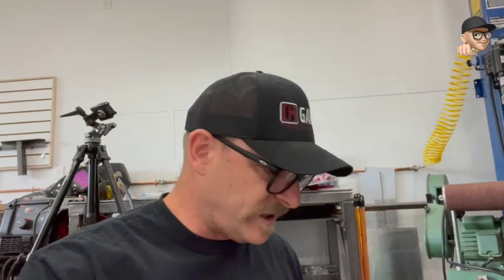I also bought this little guy here. What I found is my abrasive saw is way too noisy, way too violent, it leaves an ugly edge, it's hot, it's stinky, and it makes lots of chips. So I got this — picked it up on marketplace, a sweet deal, and I picked up some more blades for it. It's real nice for cutting things quick and dirty. I do have the larger saw over here, but it takes up a lot of room and it's slow. This thing is portable — I can work on a vice on the bench, so it just made sense.